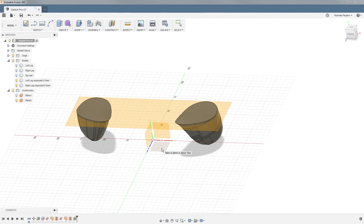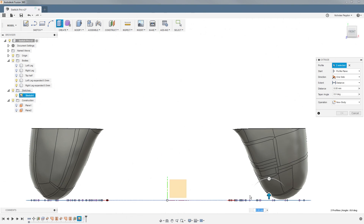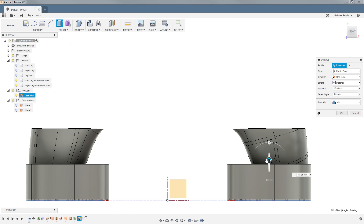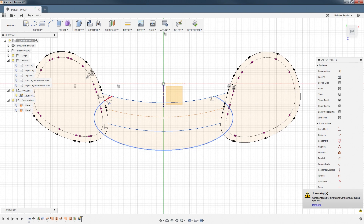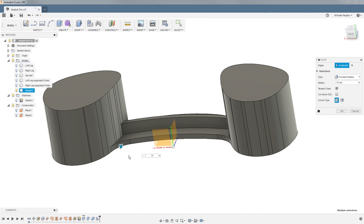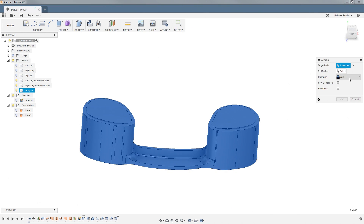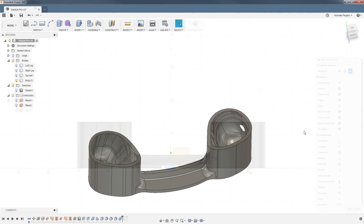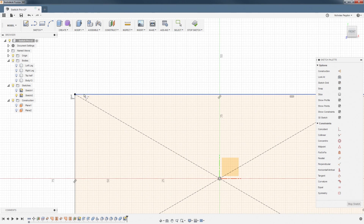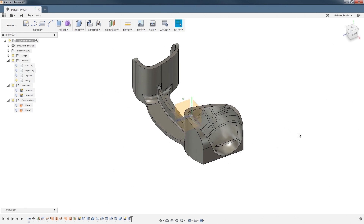While prototyping, I decided I wanted to avoid overhangs to make printing these as straightforward as possible. So I just grabbed the biggest contour I could find, offset it a few more millimeters, and extruded that the whole way down. Laying out the rest of the basic shape is simple enough: a nice curvy platform to support the center of mass, a rib for stability, then fill it all in. Now we get to subtract the leg cups. This is where being able to use an imported model like any other Fusion 360 object really shines. Slicing off the sides saves a lot of plastic, reduces printing time, and helps to keep the stand's footprint smaller.